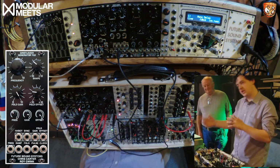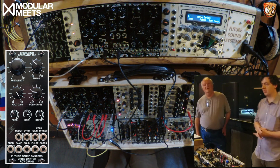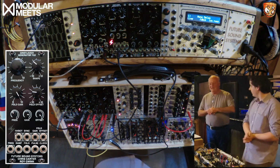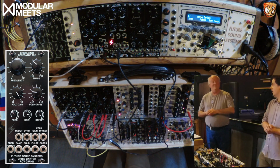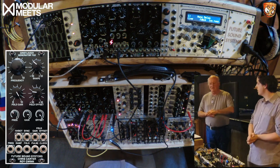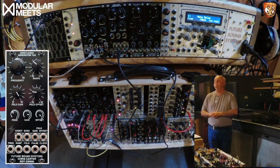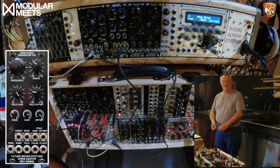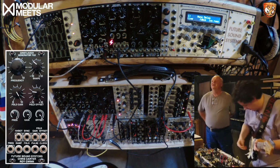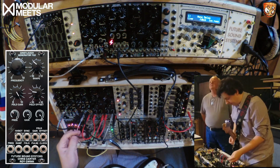You can only take the generator up to a certain point. I think we're looking at about 500 hertz at the moment, aren't we? Until it starts to kind of clip at the frequency control. But it wasn't intended to be an audio oscillator, but it does quite a bit. Yes, yeah. A comment in one of the reviews of the classic Gristleizer was it goes from zombie slow to psycho fast. So that was my specification for the frequency range of this one. 500 I think is psycho fast, and it goes down to about 1 cycle every 20 seconds or so.